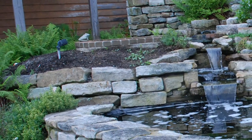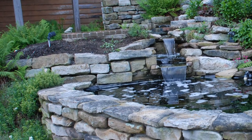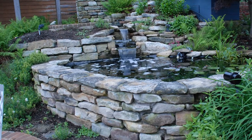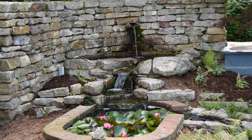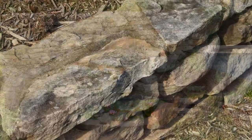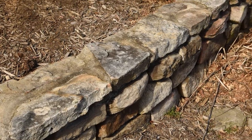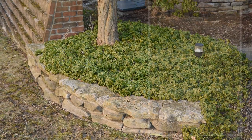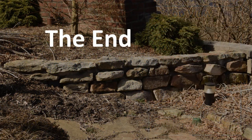The middle pond was capped with brick, backfilled, and is shown in the background. The wall on the near side of the lower pond is an Ivany block reinforced concrete wall with stone facing. The pond was lined with a butyl liner. The large wall in the background is a traditional stacked stone wall filled with a cement core. Ivany block walls are permanent and durable structures — easy to construct, and they can often be built from beginning to end in one day. Faced with cut stone or brick, they make a naturalistic-looking retaining wall.